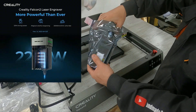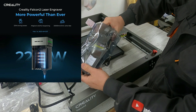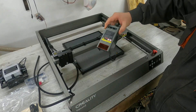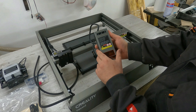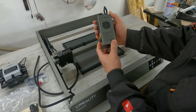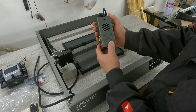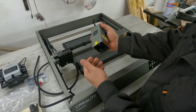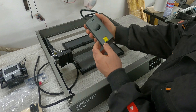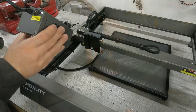Here we have a 22-watt laser head that combines four 6-watt lasers, and all that power goes to one point. We have three indicator lights. The laser head is quite massive, made of thick material, with a fan for cooling and smoke extraction. At the back of the laser head there is a rail for attaching it to the moving mechanism. The laser head weighs around 500 grams.